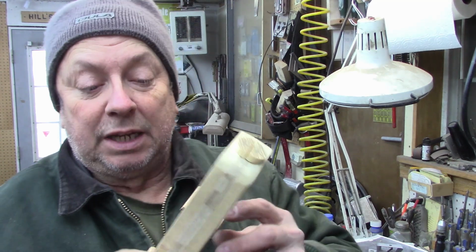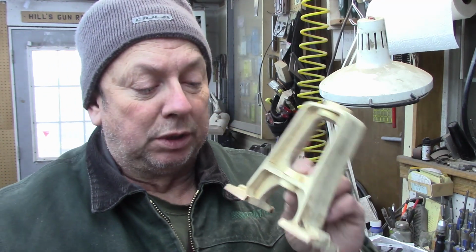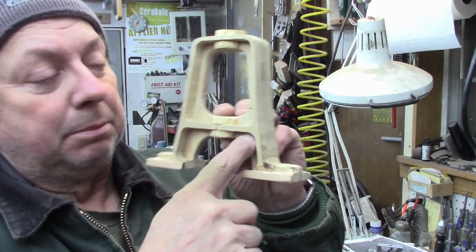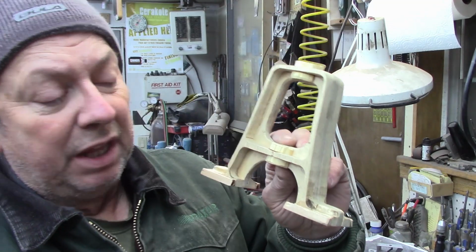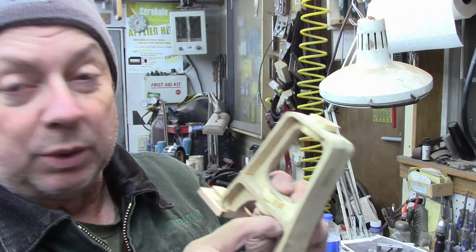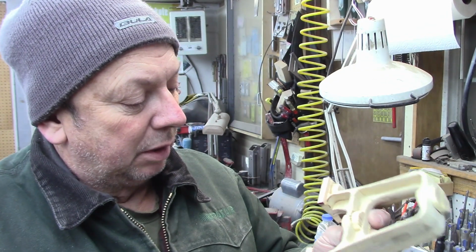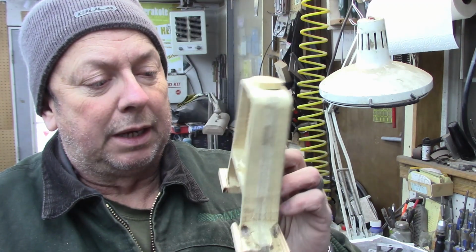The other thing that I've got to do, which I'll do probably after the first or second coat of filler, is drill for alignment pins or index pins. On this one, where I think I'm going to mount it on a match plate, I'll probably drill three alignment pins for it. I'll probably do one down here someplace, one right in here, and then one up in an upper corner. So we've kind of zigzagged around. 3's plenty. They're kind of a pain in the butt when they're recessed down in there like that, but that's okay. We'll get them smoothed out, and they'll be fine in the finished product. But anyway, there's our progress for now. I'm going to add a coat of filler here, and then I'm going to go get some lunch. So we'll be back in a bit.